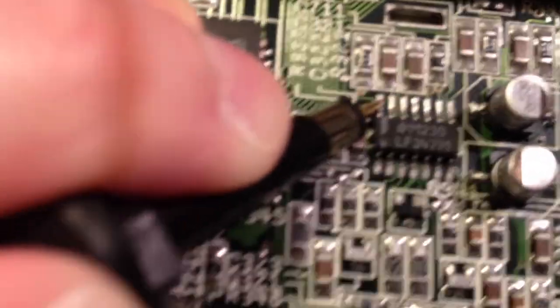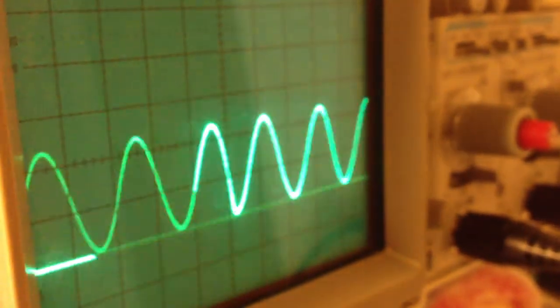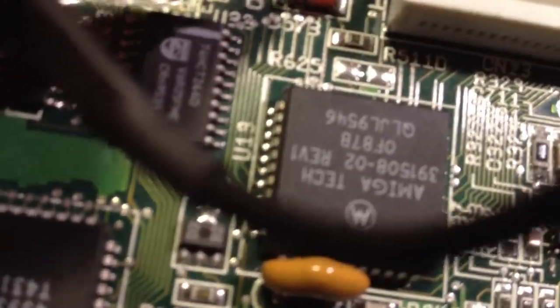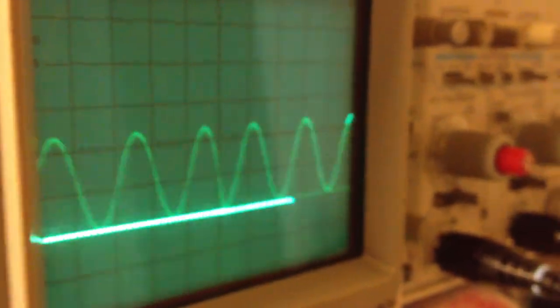Let's compare with the other motherboard. This is the motherboard with revision 1D, and I still have the same sine wave running in ProTracker. That is much, much better. The swing is not dipping down into the negative — it's only on the positive side. And if we look at the positive terminal of the capacitor, it is not getting reverse biased at all. Good for the cap.